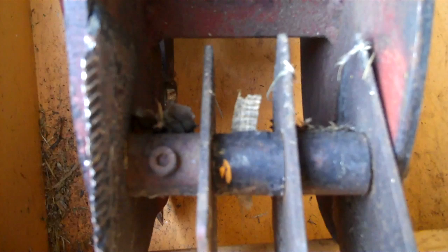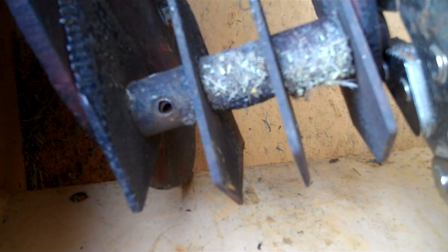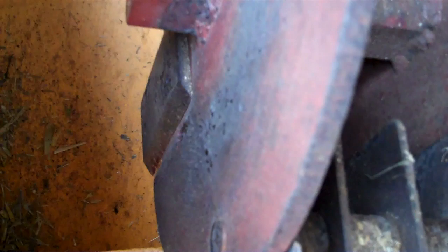I'm taking the Allen wrench bolt off, and it does have a locking nut on the other side. Just grab it with a pair of pliers and twist it right off. Once you take off the Allen bolt and nut, that allows the main bolt to move freely. There's one on each side — just put a wrench on that and unscrew it. One side is almost invisible — that's the side with the threads on it. The other side has a little tiny nub sticking out; just grab that with a pair of pliers and unscrew it, and it'll come right out.